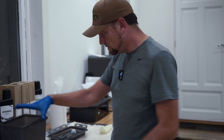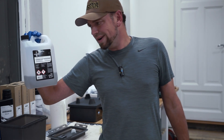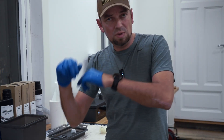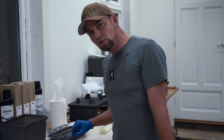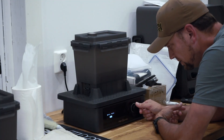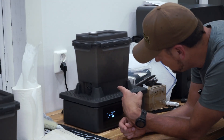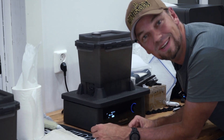What I've done now is fill this tub with isopropyl alcohol — in my case I'm using carburetor liquid, which is basically the exact same thing: technical alcohol at 99.7%. I dunked the parts in here and now we're going to run this through the washing station — three minutes at 180 RPMs. Actually, I'm going to do five minutes.